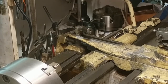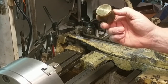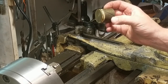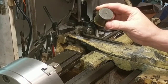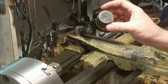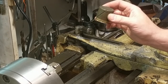For the half nut I'm going to be using this piece of brass. I bought it at an antique store a few years back — it was about five inches long, I made it into a brass hammer and saved the rest. It's an inch and a half in diameter. In a perfect world I wish it were an inch and three-quarter in diameter for the ears of the half nut to be as long as I'd like them to be.